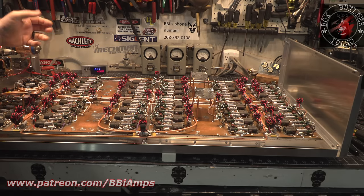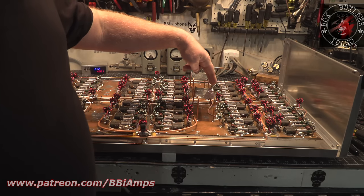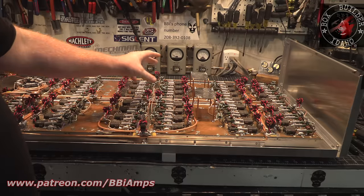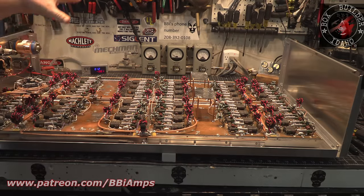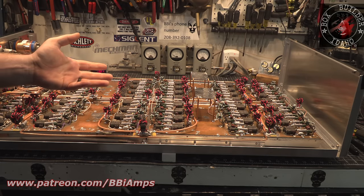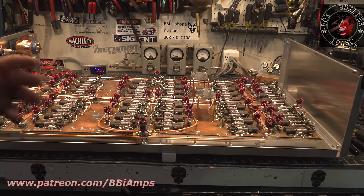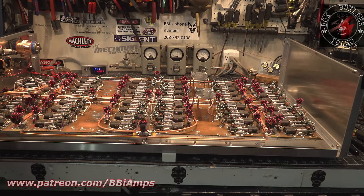The way we did this is we brought the input section over here together, this input section together, this input section together, this one together, and this one together. So at 2000 watts going in, we split that six ways, it works out to be roughly about 300 watts. Well, 316 can easily carry that 300 watts, especially over this distance, which works out to be about 3.5-4 feet. Easily.